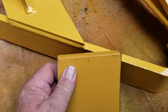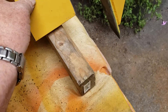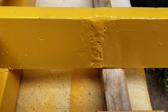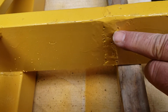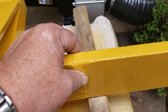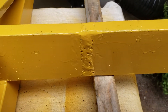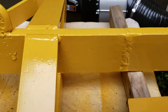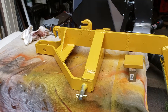I cut out four inches from the main shaft. I chamfered the two ends to a point, put them together with some clamps and a few multi-pass welds, and put it back together. Before I cleaned it up and painted it, I welded on a couple of chain hooks.